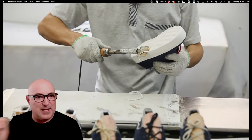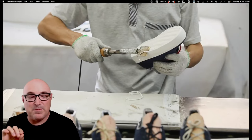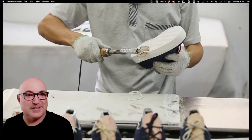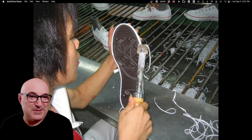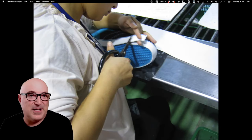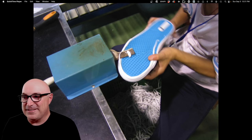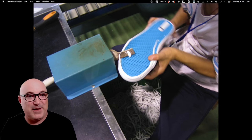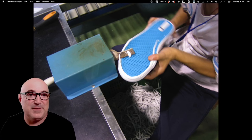When you wrap the tape around by hand, it's not always 100% aligned to the bottom. But since the rubber hasn't been vulcanized yet, it's still really soft. The worker has a little hot knife and just glides around to trim off the excess — it just makes it nice and straight. In another factory variation, the hot knife is mounted to the bench and the worker glides the shoe past the fixed knife to make the cut.